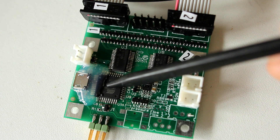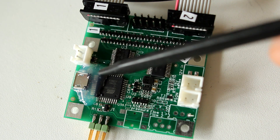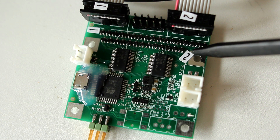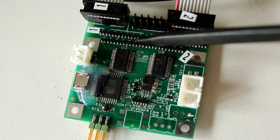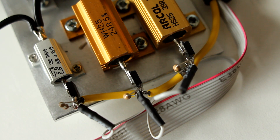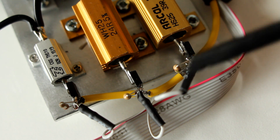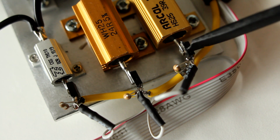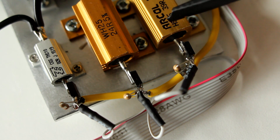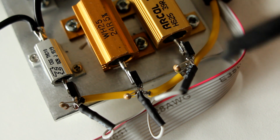All this microcontroller does is measure voltage, measure current, and turn these little MOSFETs on and off. Now obviously these little MOSFETs are not going to be turning on a whole lot of current. So on the other side we have this switched output, which basically switches on a P-MOSFET that is tied directly to the load, and all the grounds are common. With this arrangement I can turn these power resistors on and off.